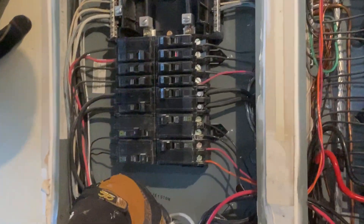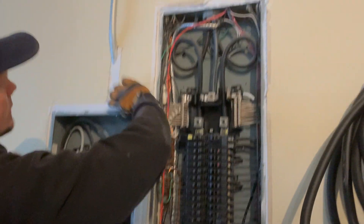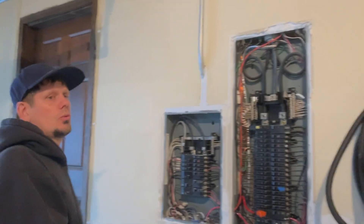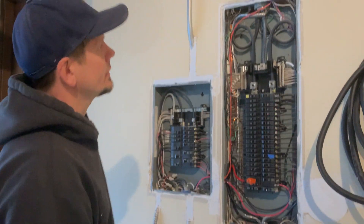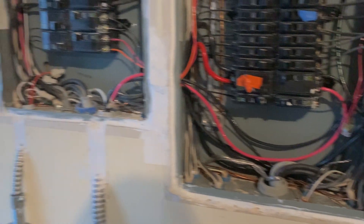One of these is their new mini split — I doubt they'll run that when they're not in the living room and they're in bed. So balance your loads is my point. This panel was already here. I did caulk around the panel and filled in my holes because you have to for atmosphere, different temperature ratings, also wind and air coming in. That's an energy code in Fort Collins, but also NEC Article 300 talks about filling your holes. You do not have to worry about the air between this panel — you're not in explosion proof. You do put your plastic bushings on — for any wire number four and larger, you have to have a plastic bushing. The other ones you do not, but I did anyway.